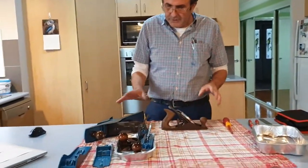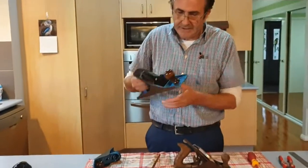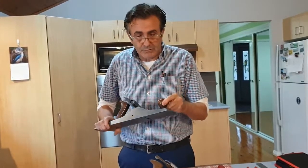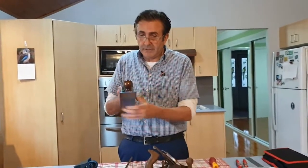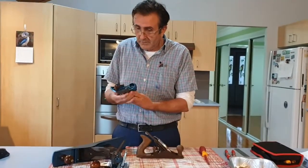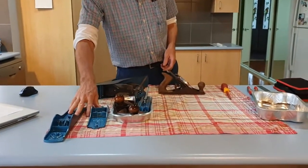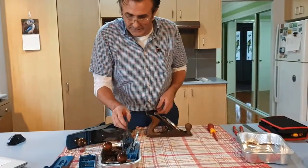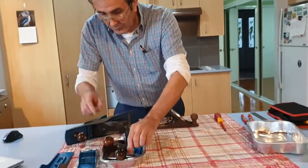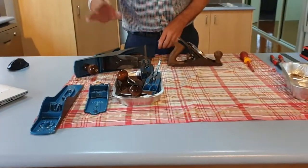You can see here on the bench I've got a few different planes that I've restored. There's a couple here being restored. This is my number six plane — I've had this for over 30, 35 years. That was one of my main planes in my carpentry box; I used it extensively for hanging doors. There's a little block plane that I use quite a lot, just been restored. And we've got a number five and a number four here — stripped and painted. The frog's in here, the lateral side movement levers, all in good condition. The rosewood back handles have been lacquered, ready to go.